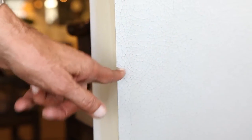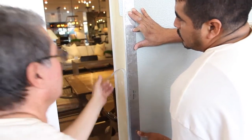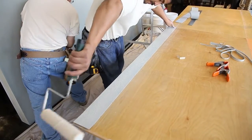At the corners we're going to butt the wall covering on this edge, so we're cutting V's into the wall covering to find out exactly where the edge is. Then we'll take our straight edge and cut from point to point to create a sharp edge right at the corner, and then the second wall covering will butt up against it on this edge.